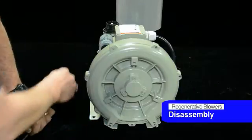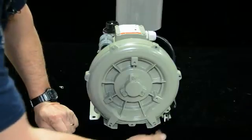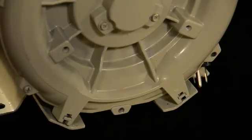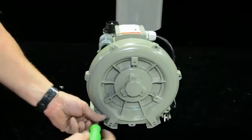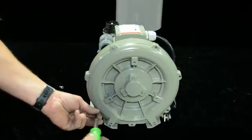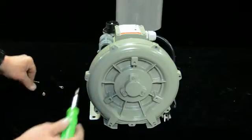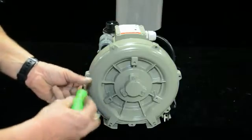The only thing you're looking for in here is if there's some junk that's not allowing it to produce air like it should. You've checked the motor amps and they're all good — everything's fine there. You just need to look in here and see if there's debris that got passed through while it was running, or maybe it backed up a little bit while running.